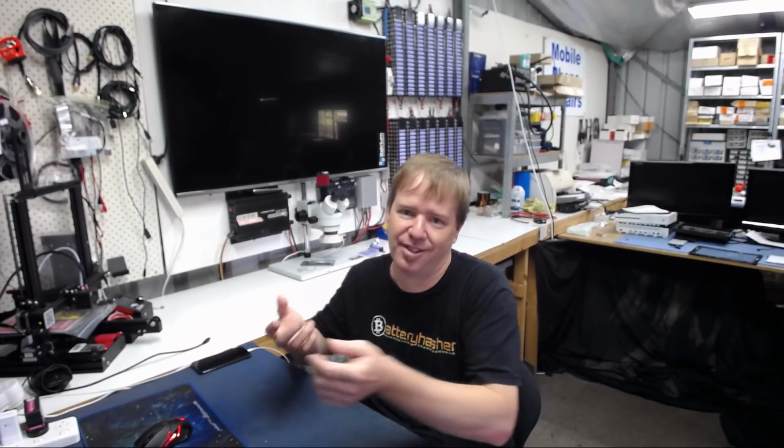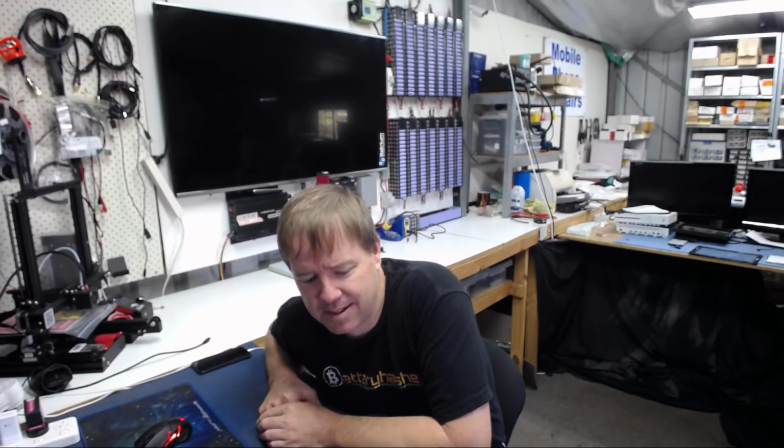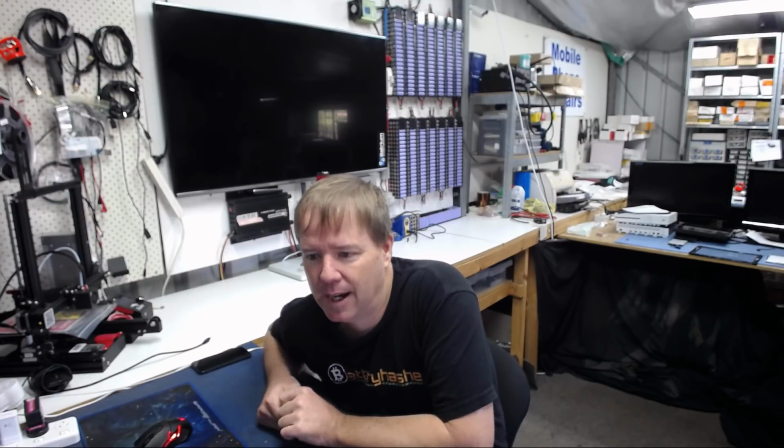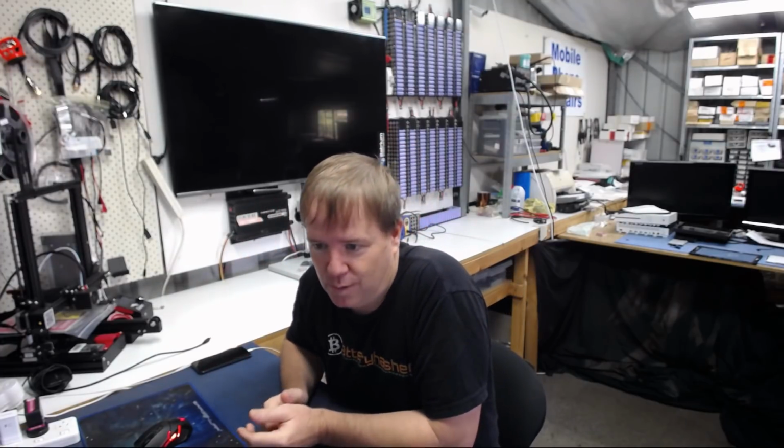Hey Pete, let's talk fuse wire. What do you use? So I use 0.2 millimeter nickel coated copper, I think, and I can't even show you because it's so small. If you go on to the forum and you refresh enough times, you will see an ad for it on the top right hand corner. That's the fuse wire that I've always used. I've never used anything else. I did do some tests on it, and in my tests, between 5 and 7 amps it blew. At about 3 amps it heated up and glowed, but if you left it at 3 amps it would glow, it wouldn't blow. It needed 5 to 7 amps to actually go pop and work as a fuse rather than a fire hazard.